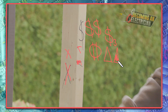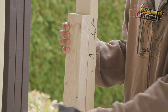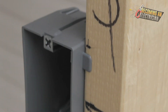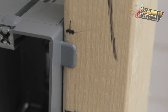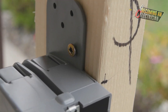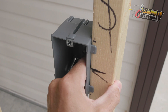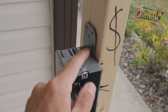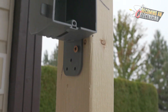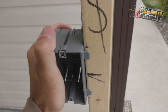The word scab is kind of weird, but essentially all it's doing is putting another piece of wood there to push the box out just a little bit from the door frame — and there's no more than two scabs. Here is how the box looks. You can see the ear tabs. Sometimes if you put your screws in a bit too tight or too much on an angle, your ear tabs will almost stick out — you don't want that either. Put your box nice and tight, put your first screw in, get your other screw from your pocket, and put it in. That is a single gang box. If I move it, there's no movement at all, which means it's a very good install.